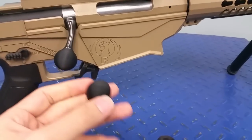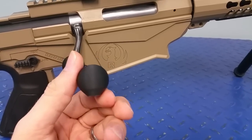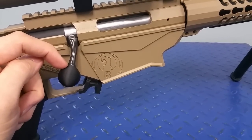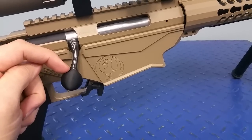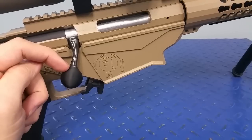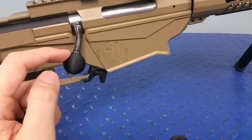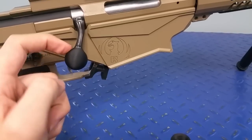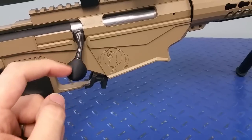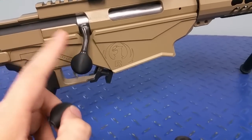I've got another guy I've been printing round bolt knobs for — I'm sending him two different sizes to try out. Round bolt knobs are actually pretty hard to print because the area where they stick to the build platform is so small. I print these without any support, so there's very little touching the heated bed. On my LulzBot Mini they tend to pop off, but on my Cubicon Single they stick perfectly every time with no support needed — they come out perfect every time.